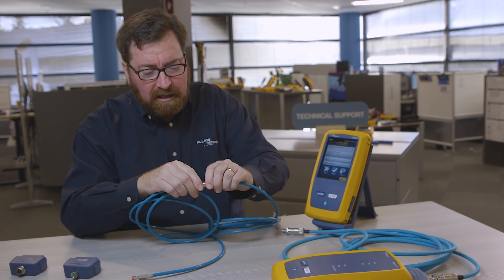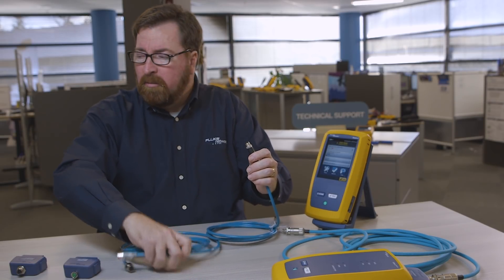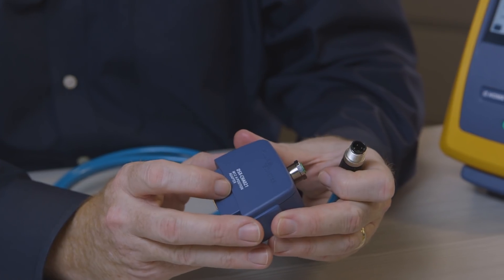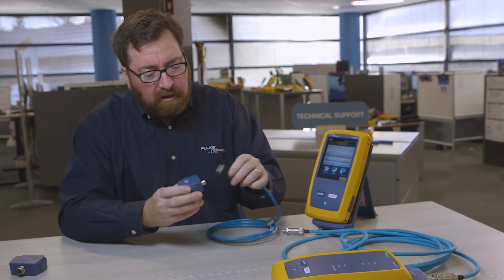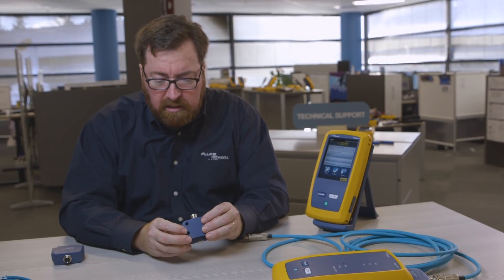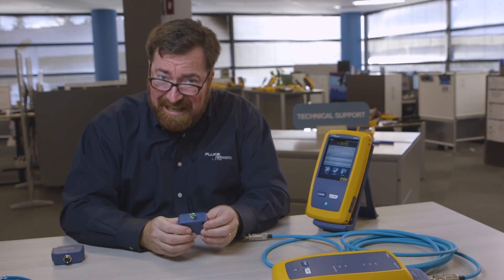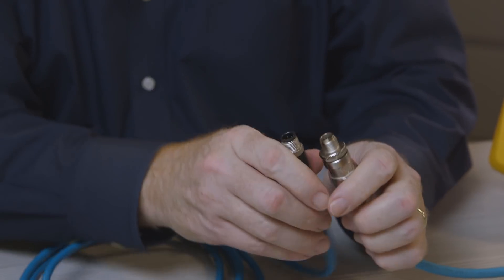So there's a more heavy-duty connector, the circular connector, known as an M12, that we're going to be coming across. Now if we want to do testing on an M12 connector, we're going to use our M12 adapter. This is what we call a D-code adapter — D for data — and the M12 four-position connector has been out for several years. With the D-code adapter, this is a four conductor or two pair. Now with two pairs we can go fast, but we can't run 10 gigabit, and that led to the introduction of the M12 X-code.